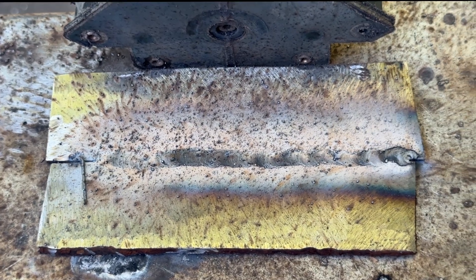That said, when you can grab a roll of Parkside flux-core wire for around €5 on sale, it does make you wonder whether a gas bottle is worth it every single time. Maybe once I get more into TIG, I'll invest in an Argon bottle and then also pick up a CO2 mix for MIG. I'll clean off the flux and we'll take a closer look at the welds a bit later on. Now let's try some stick welding, or MMA to use its proper name. Funny story — the last time someone borrowed my welder, they didn't bother to restock the electrodes they used, so I had to fall back on some Parkside electrodes I had lying around. I wasn't too confident about using them because they didn't have the usual standard coding printed on them — I was expecting them to be marked as 6013 all-purpose rods, but there was no sign of that.